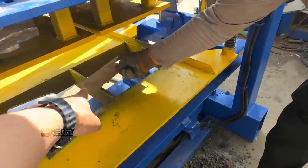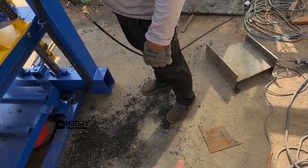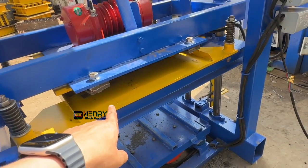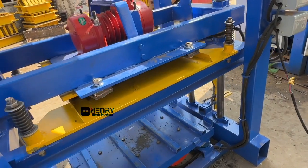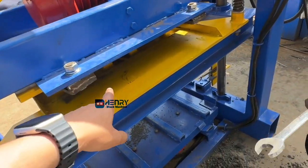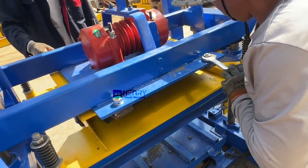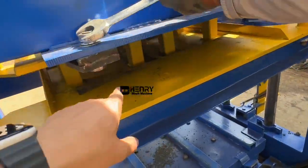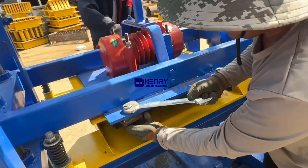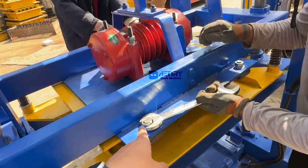Now drop down and check — you will find out this is the positioning. You just use vibration to make sure that the top mold is stuck inside the mold box completely. Then you will use the wrench to tighten the screw again.